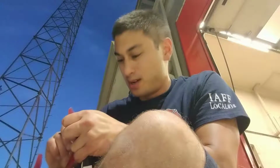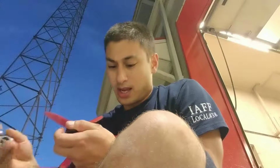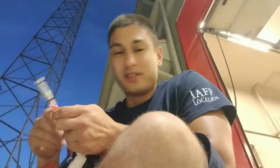So, this has been a journey, rewinding motors. Man, if you don't stay on it, it is meticulous detail you have to pay attention to, and a very specific order and way you do things. Knitting for nerds is what I'm gonna call it, because it's literally what you feel like you're doing. You're sitting there twisting wire, pulling it taut, and hoping you don't scratch one of your fragile little wires on the stator, and if you do, you have to do that whole phase over again.